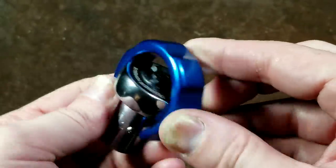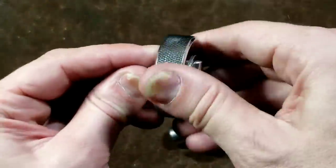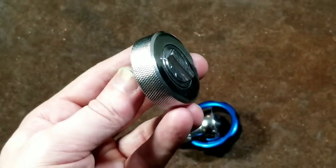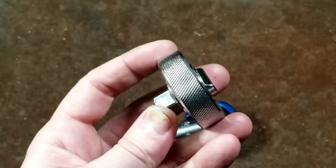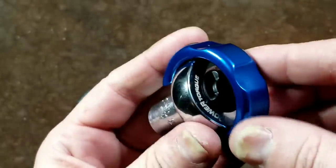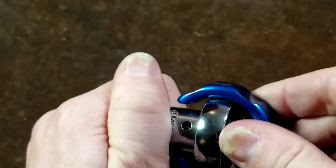What I did like is that you can flip the ring up vertically — that makes a big difference. I like thumb ratchets for quickly running fasteners in and out that may be a little rusty or have nicks in the threads, where you don't want to run a full ratchet but they're still too tight to thread in by hand. Flipping the ring up gives you quite a bit of purchase — a real nice grip to apply a lot of torque and actually get it to thread in.